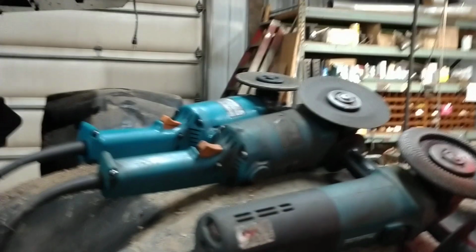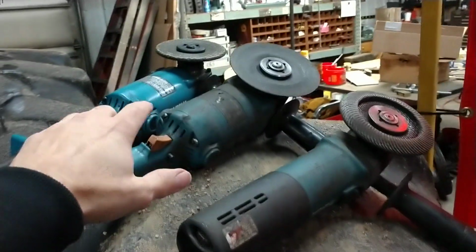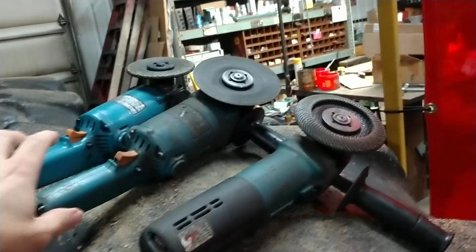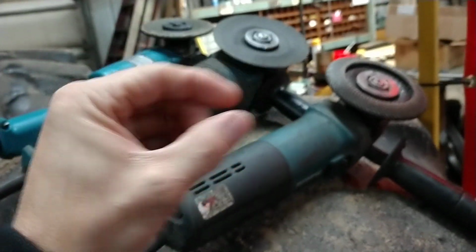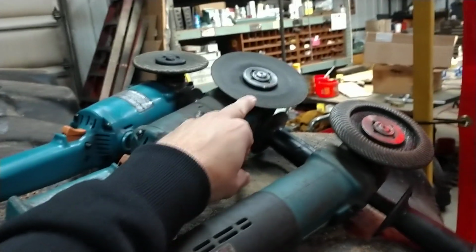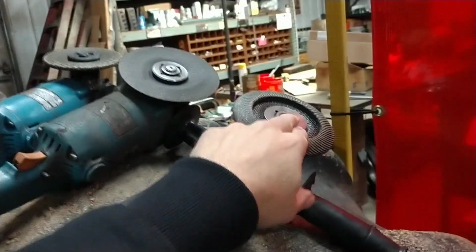Back and forth. But it's Saturday, and I think I'm going to do some other stuff. Oh, here's the 3 Amigos. When you're doing this, you got to have at least 3 grinders. You got the regular wheel, 1/4 inch, and I use all 5-inch. I don't use 4.5. I find 5-inch for my 4.5-inch grinders. That extra little 1/4 inch makes a world of difference, especially when you're using a cutoff wheel. So that's what I'll do: grind, cut, blend, and I'm all set.